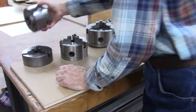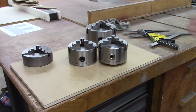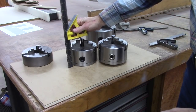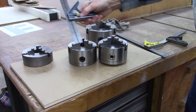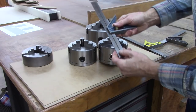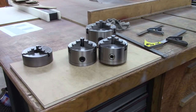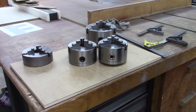These are basically the same chuck — a different brand, but they're made the same, same dimensions. They may have come out of the same factory but they've got a different brand name on them. That's the one I just modified. It's a little under 3¾ inches, and the original is 4¼ inches. So I've reduced the overhang by a half inch, which doesn't sound like much, but this chuck does better than this chuck.